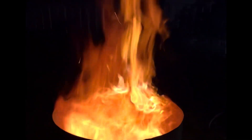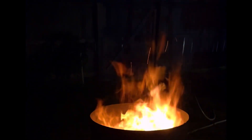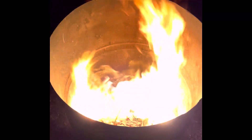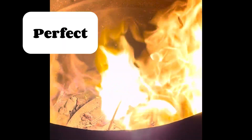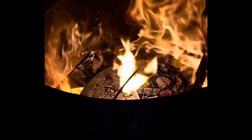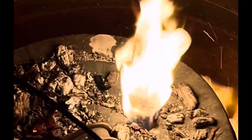Round two. I left the stack off this time — when I put it on there was smoke just like last time, but without it there's not a lot of smoke. It's just like having a regular fire in your yard and you can hear the pyrolysis happening. It's coming out of the bottom of that barrel. I put a hole in the top also, but it's working and there's way less smoke. What's happening right now is the wood inside the inner barrel is heating so strongly that it's gassing off all of its impurities — superheating without catching on fire. That's the key. The impurities are flammable, so the flames come out of the holes in the bucket and in turn help to heat the bucket. That's essentially what pyrolysis is.